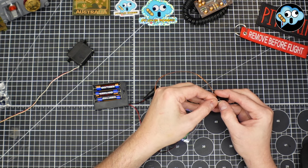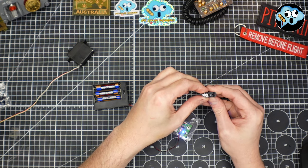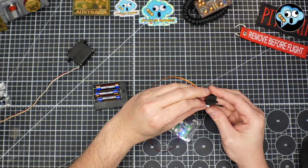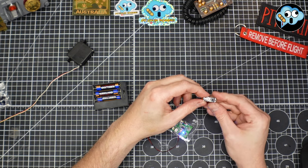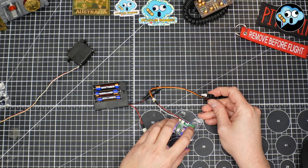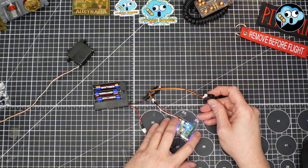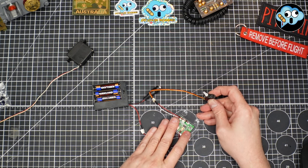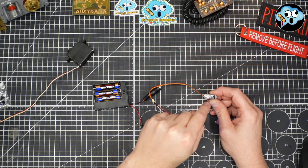And put it on the servo as close to straight back as we can. So there's teeth on that little nub that comes out of the servo horn. It is like a geared thing. And then we're going to hit this little second button here. Okay, and that's what it should do. That's perfect. And we're going to stop that. And then we're going to hit the first button again and recenter it. And this is where we need to keep it.